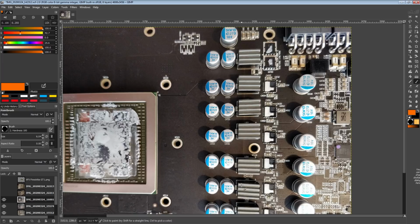That's the main reason why you wouldn't replace all of the through-hole capacitors with multi-layer ceramics, which you could theoretically do. It would start taking up tons and tons of time to assemble a card like that. Also, it would potentially take up a lot of PCB space, which is another potential concern, where it's just like, where do you even put all of them?